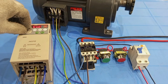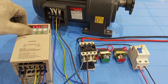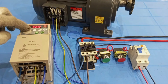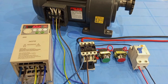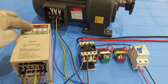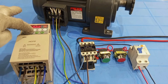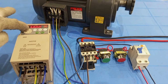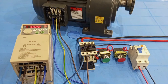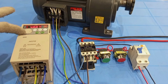I can actually use the frequency to stop the motor. I have not pressed the stop button, but I have reduced the frequency so low that the motor cannot run — and you can see that the motor has stopped. I can then use the frequency to start it again and increase the speed. As the frequency increases, the speed also increases, and as the frequency reduces, the speed also reduces.